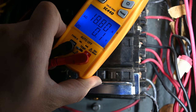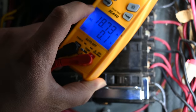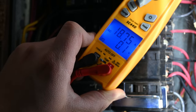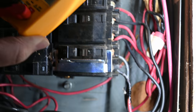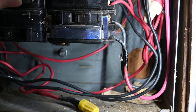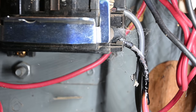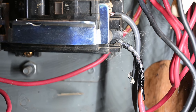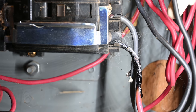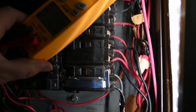This would be the correct amount of current going to the elements for this water heater. Now we're just going to observe and let it run and see what happens with the wire connected to this breaker. I'll continue to monitor the amperage and we'll see if this thing is kicking out because of amperage or because of heat, because those are the two different ways that a breaker will trip. The first way is for the breaker to simply have too much current being drawn from it. The second way is for the breaker to physically overheat to where it will then kick out automatically. Obviously you can tell there's been significant heat on this wire since the insulation has completely melted off.